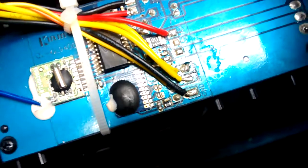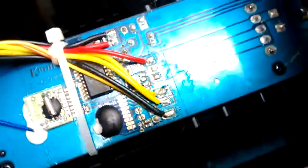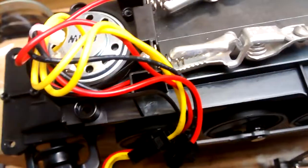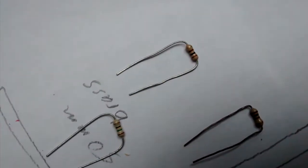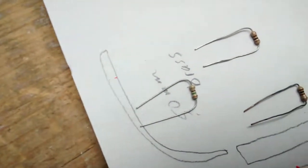So I don't know why this corrupts its own differential output that drives the speaker, which is the yellow wires. Yellow wires drive the speaker. But holding that resistor in parallel with it partially fixes it, but you have lower volume.